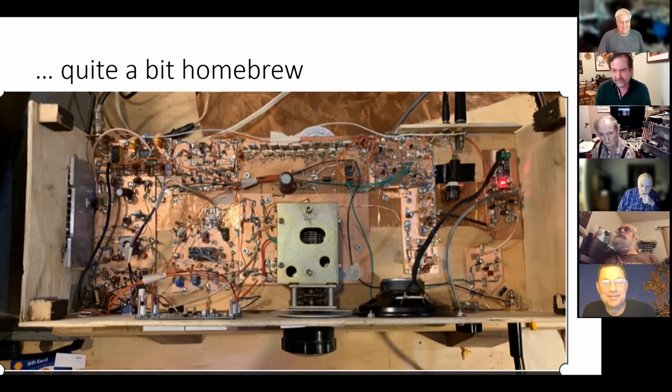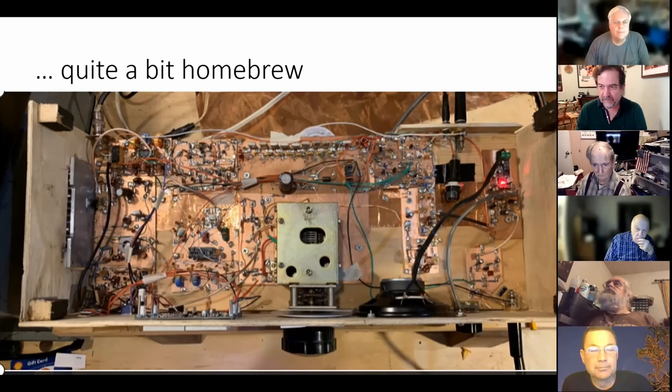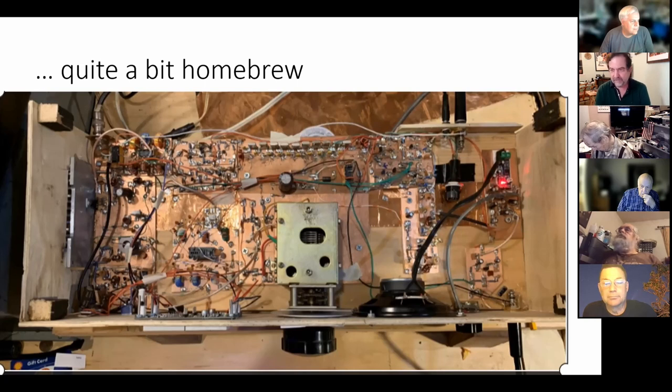I think if you want, say, a 9 megahertz VFO, the variable caps of an ARC-5 would cover like 9 to 9.5 easy. But if you get that ARC-5 thing working, the whole VFO is worth keeping. That was what people were using back in the day. And if you get one that's a complete junker, you can pull the capacitors out of it. But you might end up like I am with this thing, where you go to buy the capacitor and you end up keeping the whole VFO.